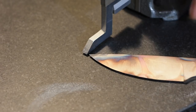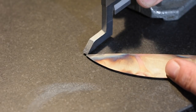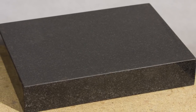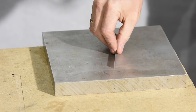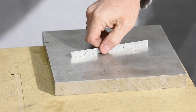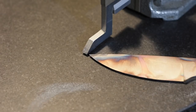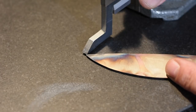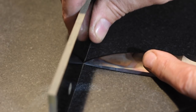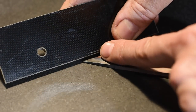Along the same lines, it's not uncommon for a tip to get shifted off to the side a little bit — sometimes from natural warping during heat treating, sometimes from bumping it during the process. So even if you had it perfectly ground going in, it can come out a little off. Simple test: just pop the blade on your surface plate — it doesn't have to be a granite surface plate, any flat engineered material like aluminum, Micarta, or glass will work — and see if your point is symmetrical. You can use a gauge or just scribe a line to tell how far off it is. At the end of the day: if you can see it, it's a problem; if you can't see it, it's not.